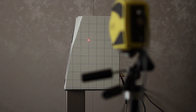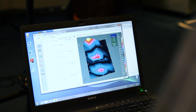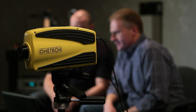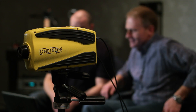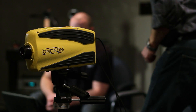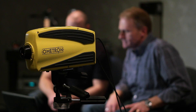We've added some technology to the company, one of those things being the laser vibrometer. We didn't have that with Duet Series 1. As we moved into Duet Series 2, we really wanted to take a hard and close look at what's happening in the enclosure — it is a pretty small volume and we've got a fairly large driver creating a lot of energy. One of the things we didn't have on Duet Series 1 is we didn't have Series 1 rigidly attached to the stand. As soon as we took the Series 2 first prototype and rigidly attached that to the stand we built, for measurement purposes, we noticed that everything got cleaned up by orders of magnitude.